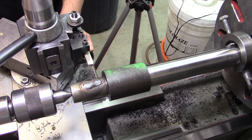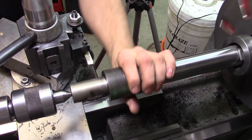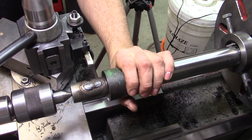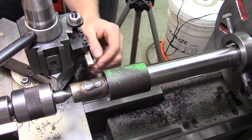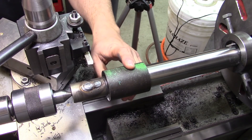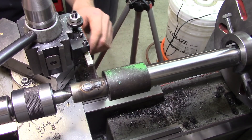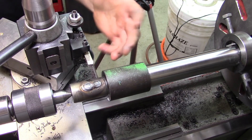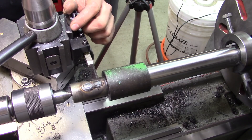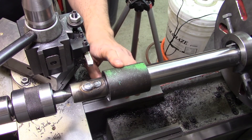I popped by the shop this afternoon. We decided that the keyway on this side is fine, and it was probably best to just fill the other side in for now. Considering what this is going on, if we clean it up and bring it back down to the right journal diameter, we're fine. That's why I'm going to use the high speed steel and carefully take that down to diameter. It's just filled with MIG weld — I know it's not the same alloy as the base — hopefully the admixture at the edges won't be too much of an issue as far as hardening. We'll just have to see. There may still be some file work done here.